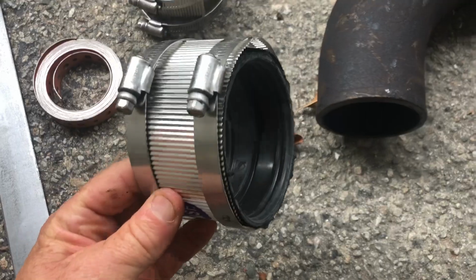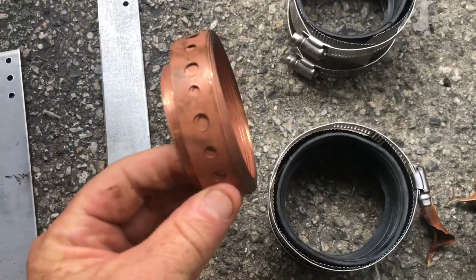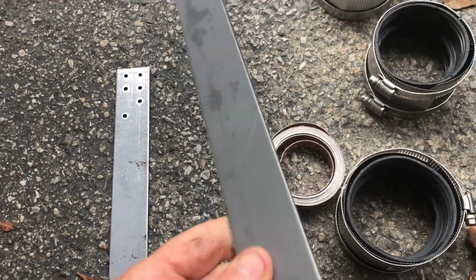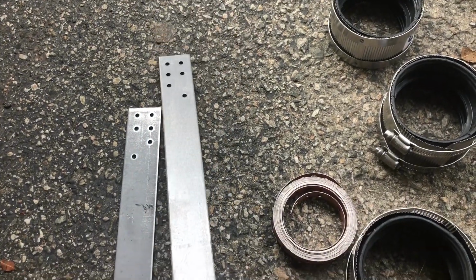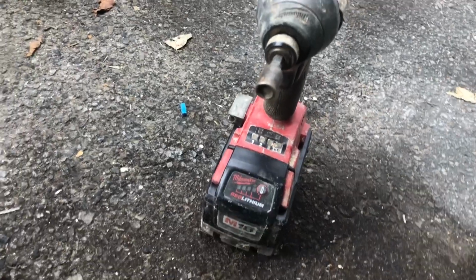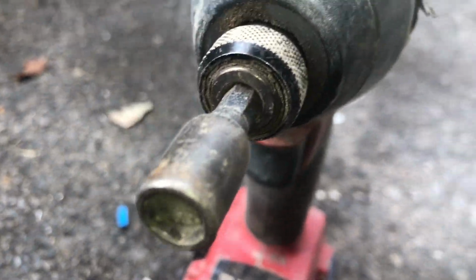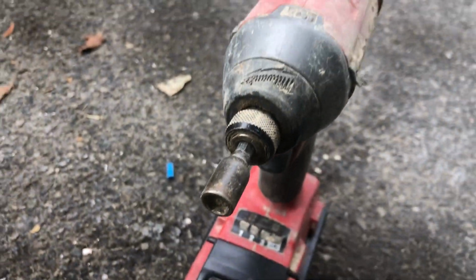Then you're going to need no-hub couplings that are approved, along with some strapping material. This is called plumber's tape. And then also reinforcement safety plates. Nails don't go in through the pipe. And then what we use is an impact drill with a 5/16 bit. What this will do is this will go right inside. Just a quicker job when you have this type of tool.